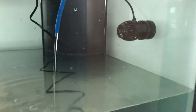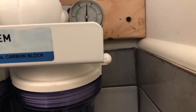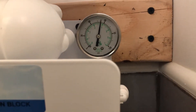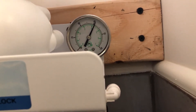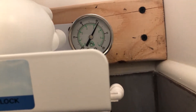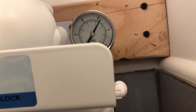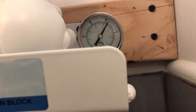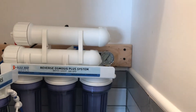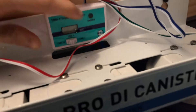Here's the other end — it's about matching the wastewater at a one-for-one pace right now. Here's the gauge — you're going to increase your RO production as your pressure goes up. I'm not quite at the pressure I should be so I'm just turning the handle slowly, watching the gauge. I know I'm going to be at about 64 to 63 PSI — that's about as good as I'm going to do. It is the middle of the day and people are using water. A lot of people in your area drawing off the main can make your pressure dip a little bit.